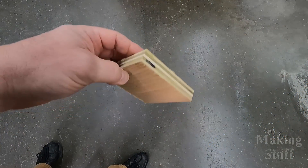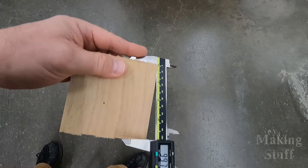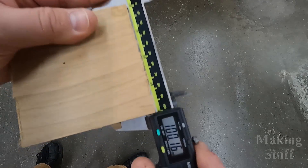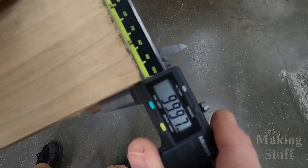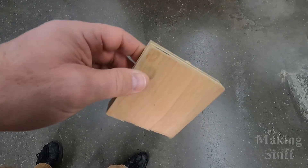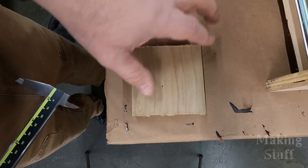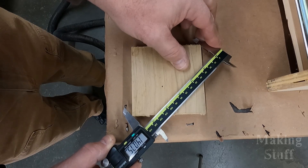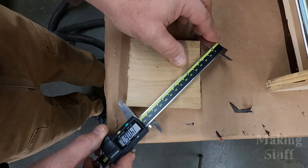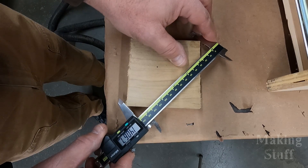Here's the test block I just cut out on the machine. It is supposed to be 100 millimeters on each side — a square with 100 millimeter sides. I've got 99.82 on one side and 99.97 on the other, so I'm very happy with that. I don't think I could get any closer with a 3D printed CNC machine. Now let's check the squareness — I'm going to measure the diagonals. On this axis we have 140.64 and on this axis 140.67, so that is dead on square.